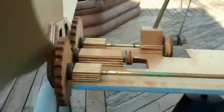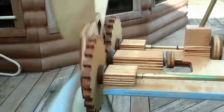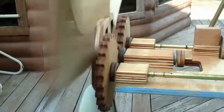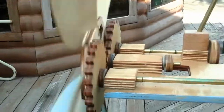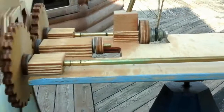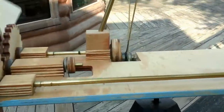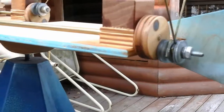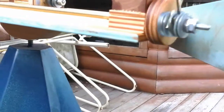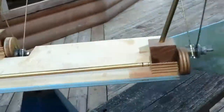The drive mechanism runs roughly a four-to-one set of reduction gears off a propeller shaft. The shafting is brass, runs in brass bushings. The crankshafts are balanced — if I can get this thing turned around here, you can see the weight in the rear end. The cranks are balanced with the operating mechanism.